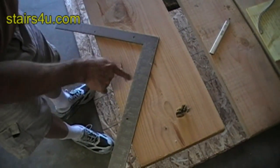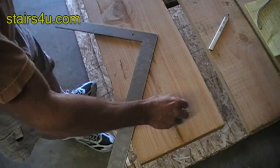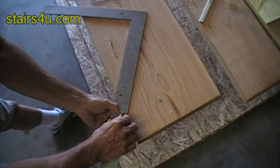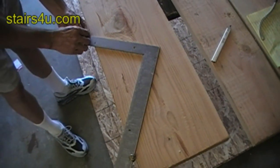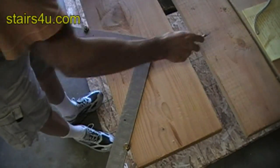Tread — that's the point for the tread, that's the point for the riser. These are the stair gauges. Once I get the framing square where I want it, I can position the stair gauges and tighten them up, secure them to the framing square, and then I can make some sample marks.